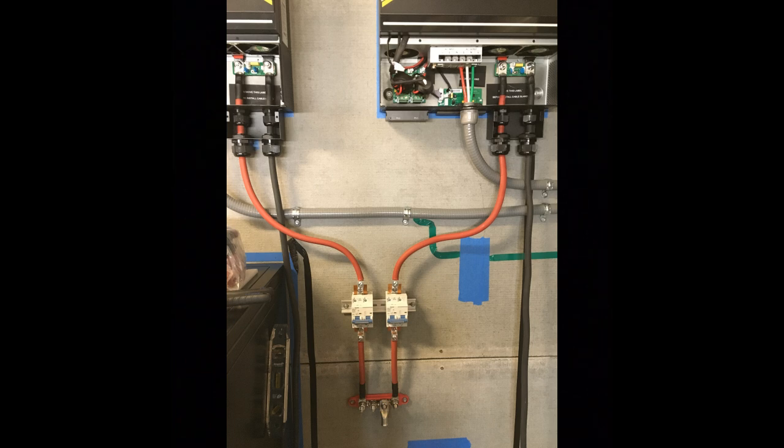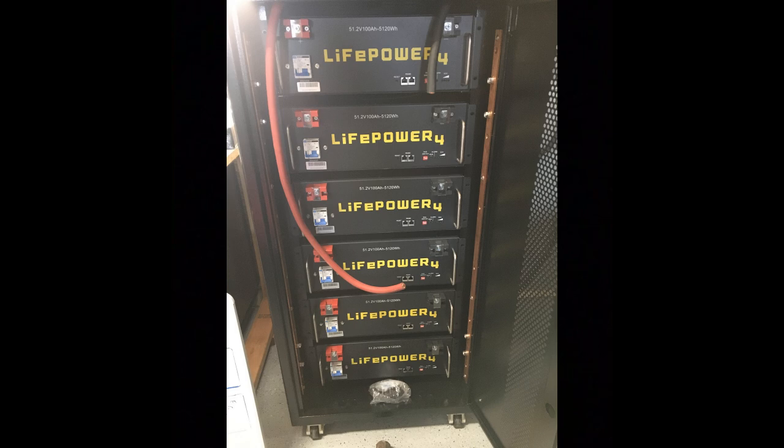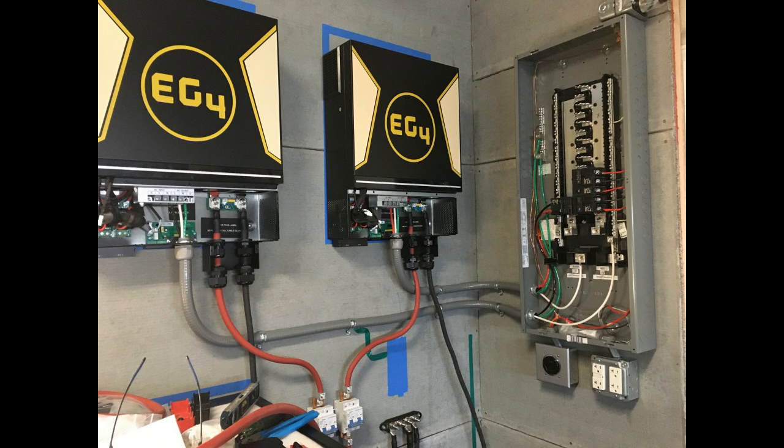Here's more of the wiring I was doing. There's the breakers and the lugs, and here's the batteries all in the box getting squared away. You have to bolt and screw them in — they're about a hundred pounds apiece, so get help if you need it. Here's my AC panel that I'm using as a junction box or sub panel, wired accordingly. There's a really good guy on the internet who teaches a lot of electricians — I'll leave the link in the description.